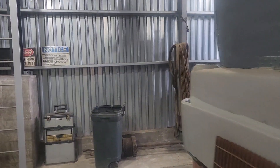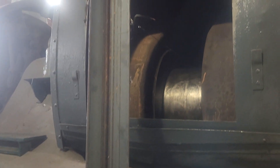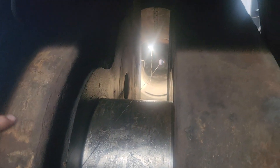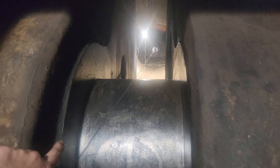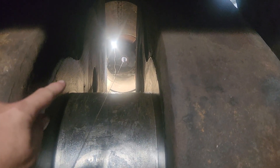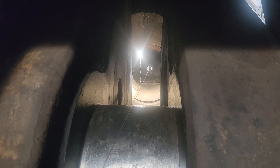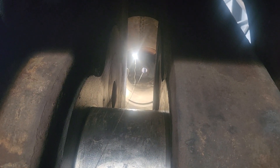Once you know that the wire is straight, you can come back here and take your measurement. Here's another piece of angle with another Harbor Freight magnet. What you do back here is measure from the wire over to this machined surface, then over to the machined surface on the other side. Then I can go all the way up to the other side of the crankshaft and measure across at those two locations, since there are bosses on both sides that are both machined.